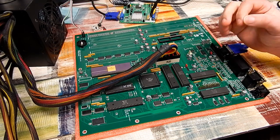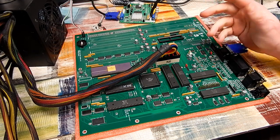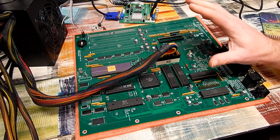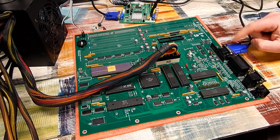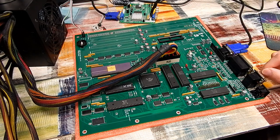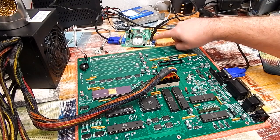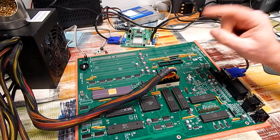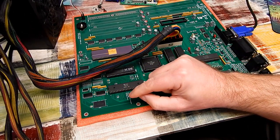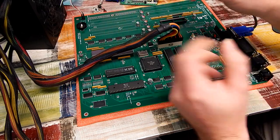Well, it's a few days later. We have made progress. We've got some good news. And we've got some bad news. And I'm very conscious that you've now been watching this video for about 42 minutes, so I'm not going to force you to sit and watch all the testing I've done, but just to talk you through it quickly. I thought the video signal that we had coming out of here looked a bit flaky going through to the SCART, so I've done away with that. Connected everything up to one of these, the old GBS 8200 scan doubler. And using that, I got a green screen. Now, on Amiga, we know green screen, that's got to be the chip RAM. So, our SRAM module, reflowed that, reflowed all of this stuff associated with it, but no difference.